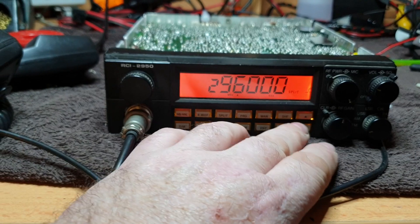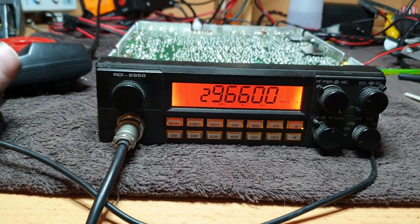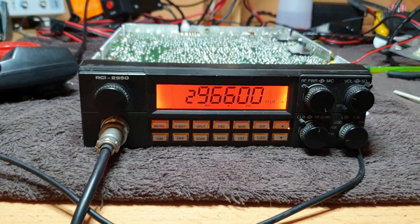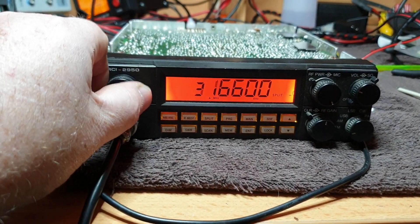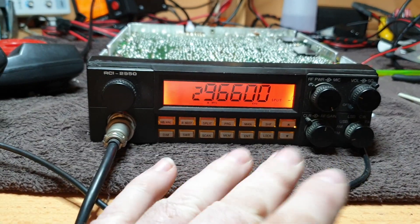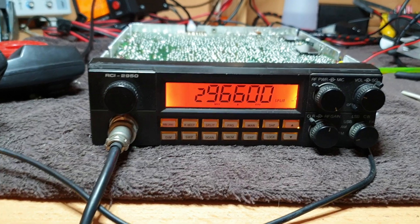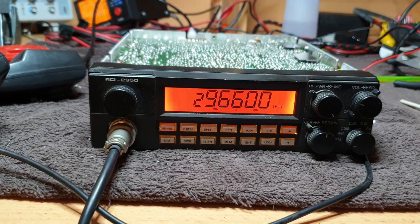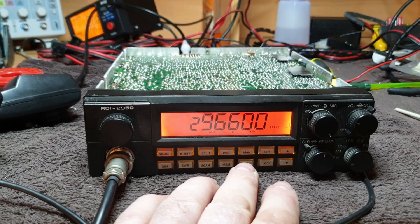I'm going to need to look at that, because that split for repeaters - if we go to 620, 640, 660, there's repeaters - but of course we want it to lose 100 kcs, which it's not doing at the moment. Some of the problems with these radios, when you extend their range to 30, 31, 26, 27, 28, sometimes you lose split features. Our next job will be converting this back to absolutely standard - 28 to 29.7 - so the 100 kc split works properly.